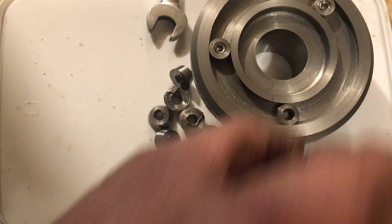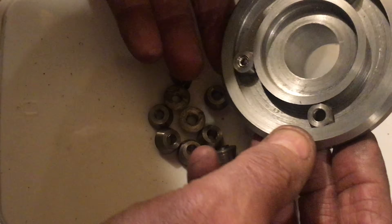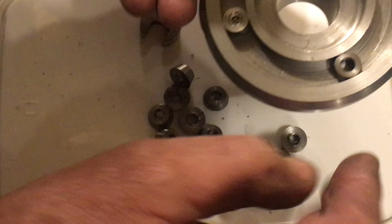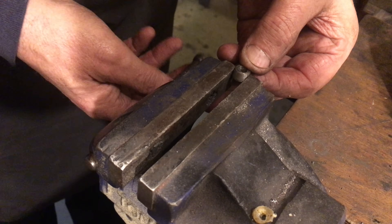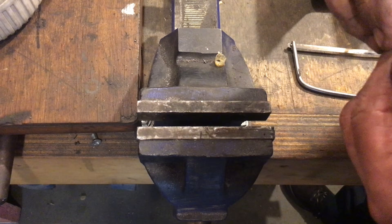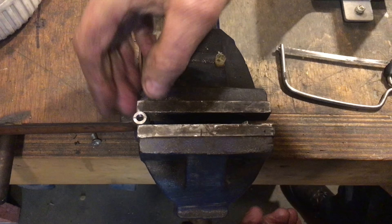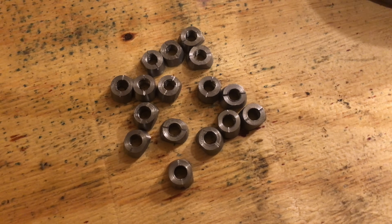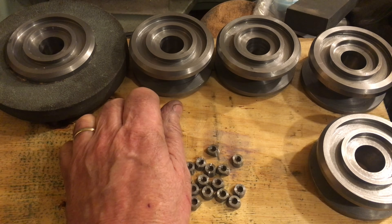By trapping I mean that once in the groove I needed to rotate it to keep it from simply falling out, but this was difficult to see what orientation it was set at. To fix this issue I simply marked the small end using a small hacksaw. Now when I move these little buttons about I know that they are in a safe condition when the saw mark is lined up radially to the spindle.